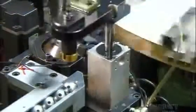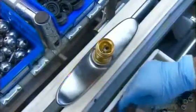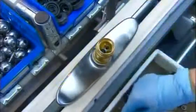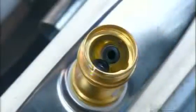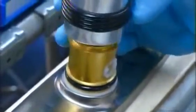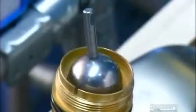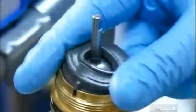Next, a robot puts one half of a stainless steel ball in a spinning vise, which properly orients it so an automated welder can join it to the other half. The ball's openings align with hot and cold inlets in the faucet body to regulate the flow of water into the spout. They insert rubber seals in those inlet holes, and rubber O-rings on the body both form a seal and allow the spout to swivel. In goes the ball valve, then they cap it with a rubber seal.